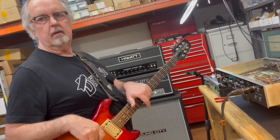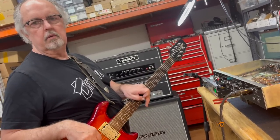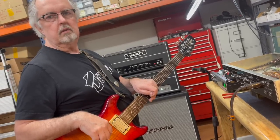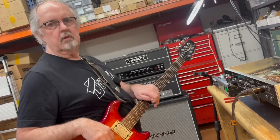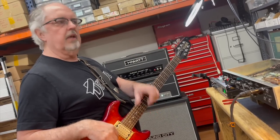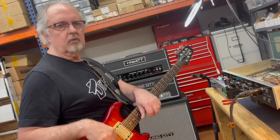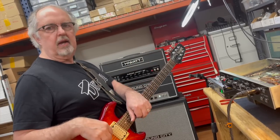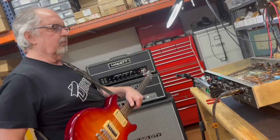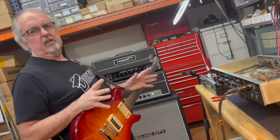I don't know if it's making its way to the video, but just listening to it and even watching you play here in the room, it seems like the power tubes are pretty tired. Well, does it feel that way when you're playing? I don't think so, no. When I put them on the scope, they're running right up at 112 watts. We tested it after we changed the capacitor, and it was right up there where it belongs. That is really how much the behavior of the 6CA7s can affect the performance of the amp,